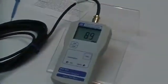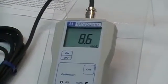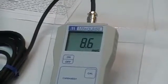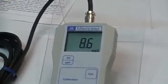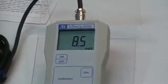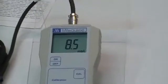As you can see, numbers are already starting to fall on the display. They will continue to fall as the electrolyte inside the membrane continues to take a charge — that's what we're doing, charging up the electrolyte inside the membrane. Usually this procedure will take between 5 and 10 minutes to stabilize. We recommend giving it a minimum of 5 minutes before it is stabilized. For the sake of shortening this demo, we're going to go ahead and do the 100% cal position.